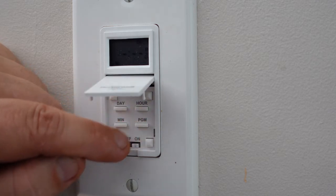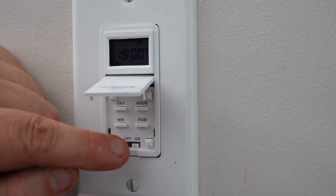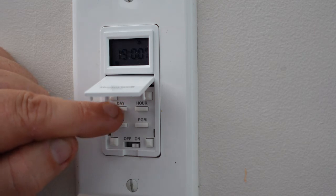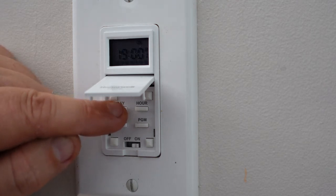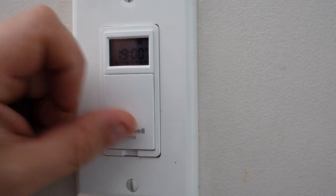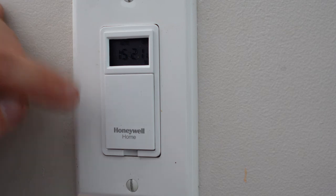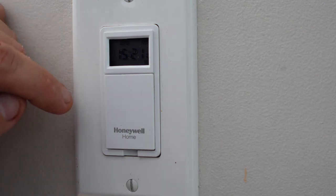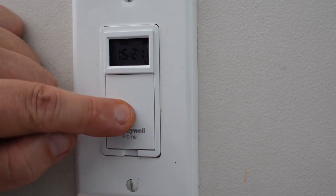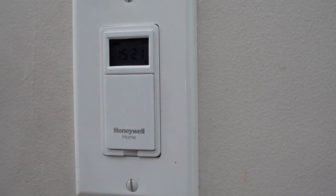Now it's off, and it runs into programs two, three, four, five, six, seven, then goes back to program one. But I'd like this program to run every day of the week, so if I hit the day button it will go through each day of the week, and the last selection is every day. I close the door and right now it's on auto — it's currently off. Tonight at 7pm it will click to on, and then at 10pm it will click off. If I don't want to run it in auto mode I just press and hold it, and it goes to manual and will stay off like a regular switch.